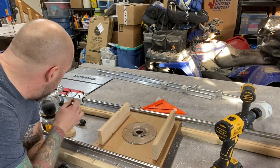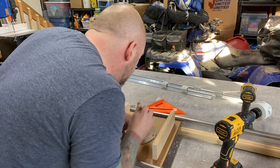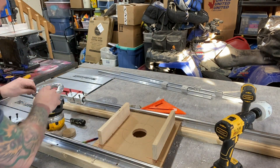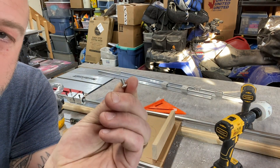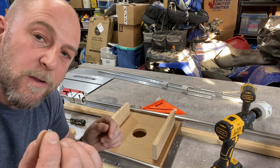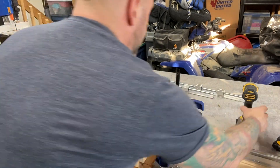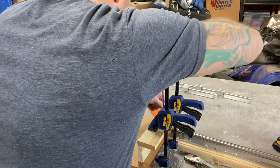To get the holes I need to attach my router, I just use the plastic router base from before and line it all up. The thing is I don't have long enough screws — these are the standard ones but I need ones that are going to be probably three-quarters of an inch long, so I need to go get some. I added some glue and put my cross beam here with a couple of one-inch screws, pre-drilled as always.